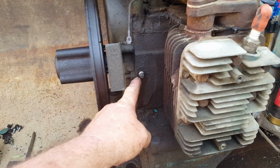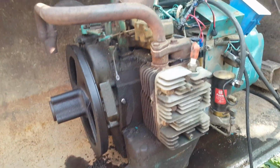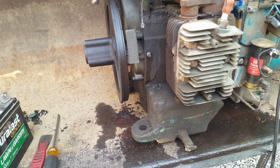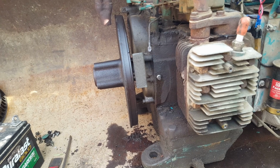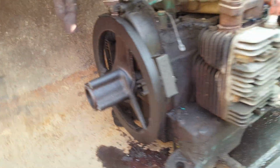All right, I put an 1/8 inch pipe plug in there for the time being. It'll be fine like that because I don't even have that hooked up to all the stuff. Anyway, I'm pretty sure a small block Chevrolet oil sending unit for a light will work. So that's probably what I'm going to get. They're $9 at O'Reilly. And anyway, I'm going to start scraping and cleaning all this old gunk off.